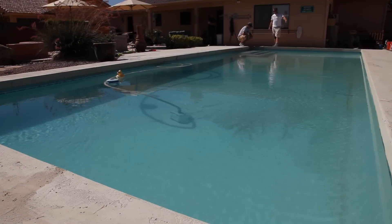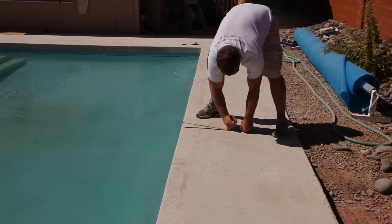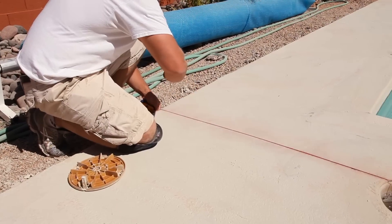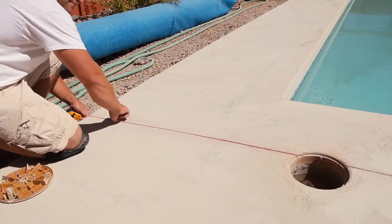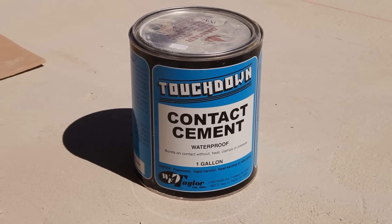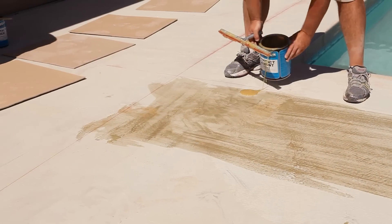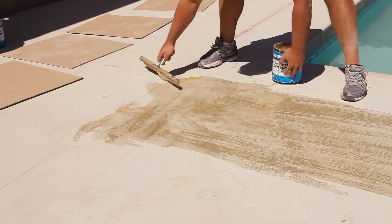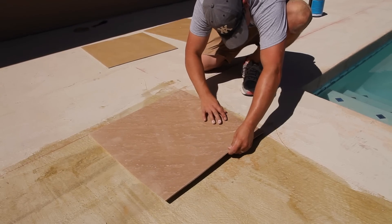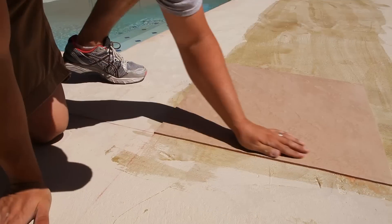Aside from the actual adhesive, the steps between the glue-down and sticky-back tiles are essentially the same. We'll begin by measuring the perimeter of the pool and prepping the area for installation. We use a chalk line to help guide the process and a neoprene-based contact cement as the installation method. We'll start by spreading enough adhesive over enough area to lay three or four tiles, as well as prep a few tiles by painting the back side with adhesive for extra hold.